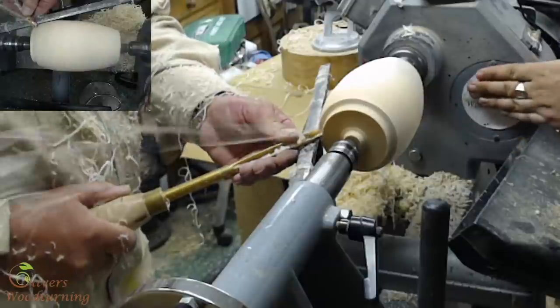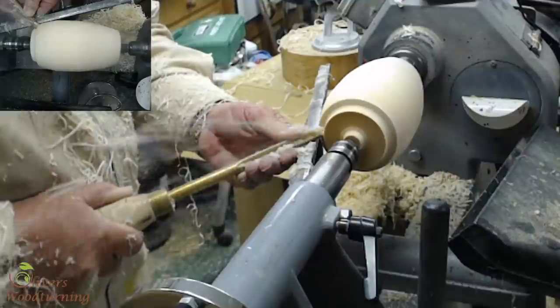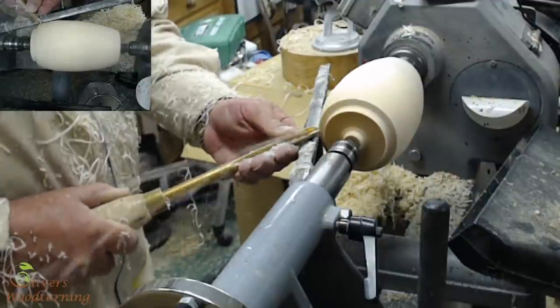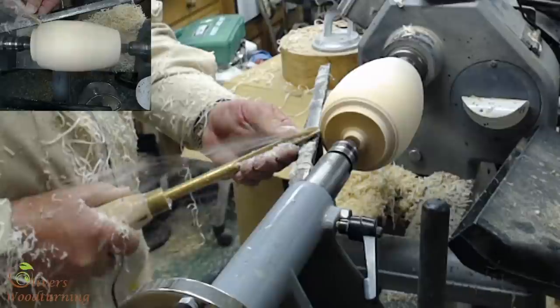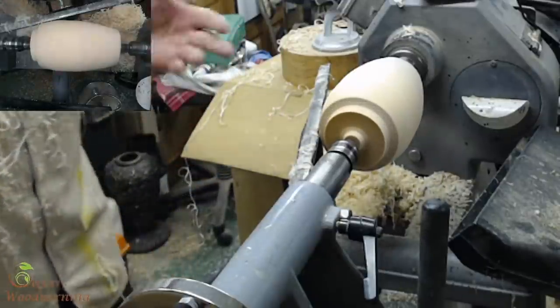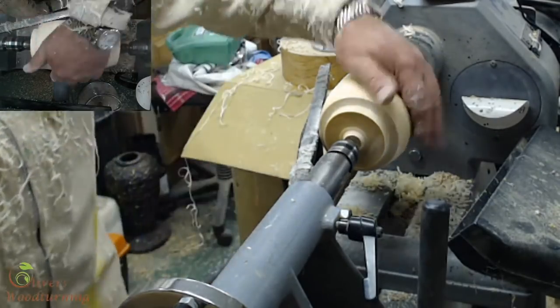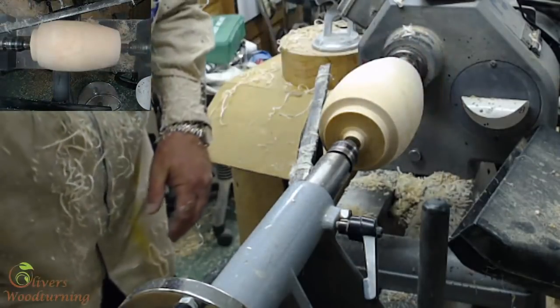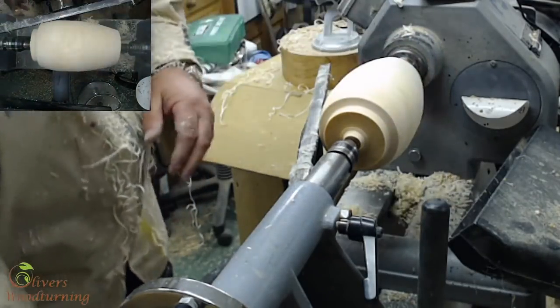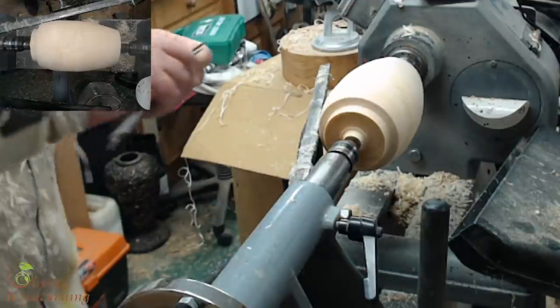Okay, so I'm just marking out a bit of waste wood here and me spigot. I'll clear that in. Because it's wet, the wood might try and move. So I'll make the spigot a bit deeper, and the only reason I'm making it deeper is not the size of the form, is because the wood is still soaking wet. It's as if it's been fresh cut. So, where I shot my shavings is all over my shelf where my calipers and that are. So I've got to unbury them. A bit of forward planning would have been good.